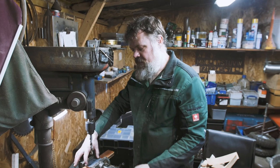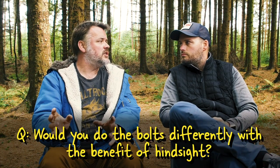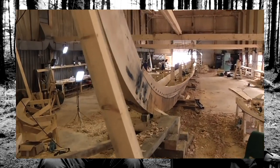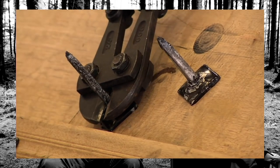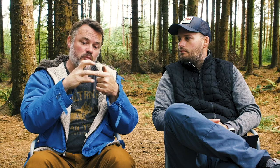So if you remember the video that we showed you — the Norwegian boat builders? Some guys in Sweden that are making this huge Viking ship — it's like 65 meters long or something. They build that boat in the style that they call clinker built. I thought it was the planks, but it's not — it's the closing of a rivet. They drive the rivet through the boat or a nail through the boat, put the washer over the other end, snip it off to a set measurement with bolt cutters, and then the process of clinkering is hitting that end of the nail a hundred times with a hammer to round over and form the other side of that rivet holding it. All done cold — cold forged.